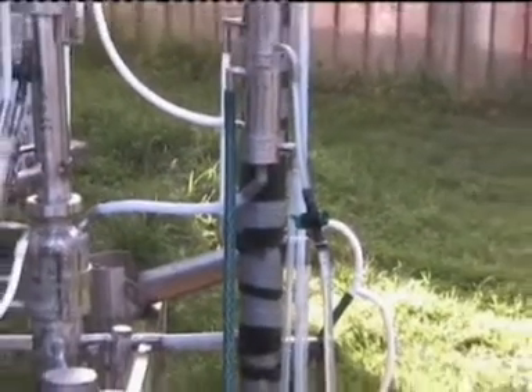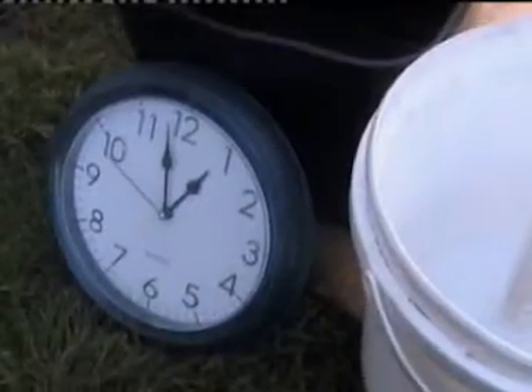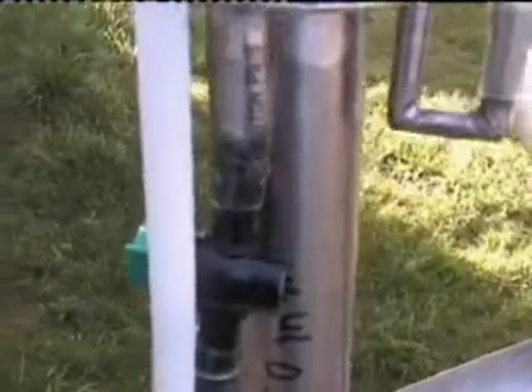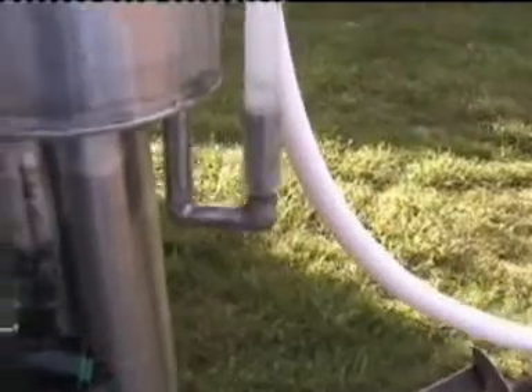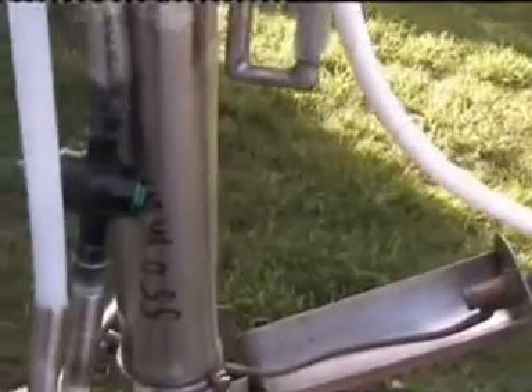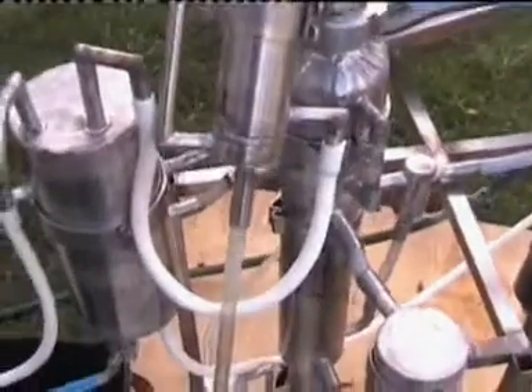You can see that the system is working properly and stable. We've got a clock over here, and I've already adjusted the speed of flow at approximately 2 liters per hour. You see there's a tap — it's slightly closed. What we're doing by closing this tap is actually reducing the amount of spirit we're taking out and sending some spirit back. By getting back, it forces the steam to become liquid, and the steam coming up forces the liquid to become steam. As a result, we get only the highest fraction reaching the top of the column, so we should get a very high percentage spirit.